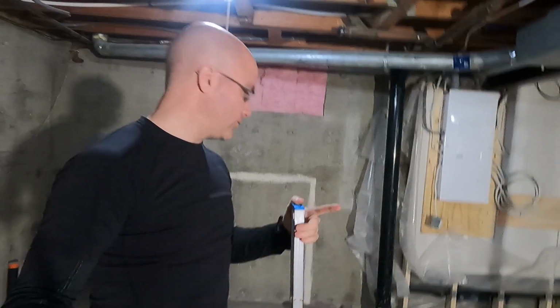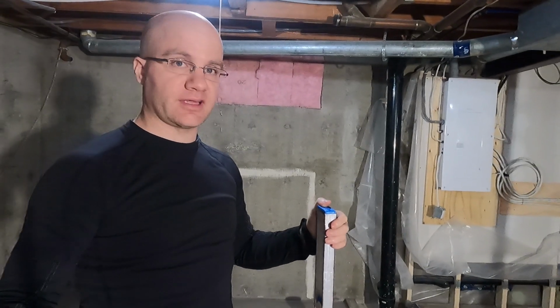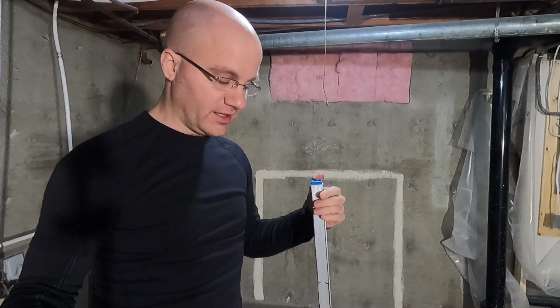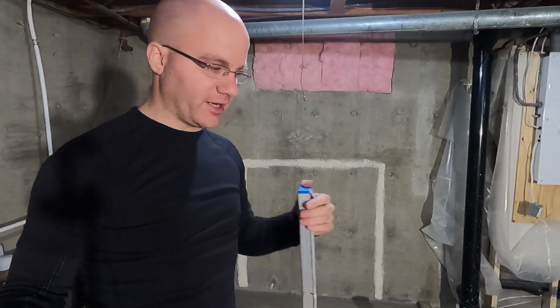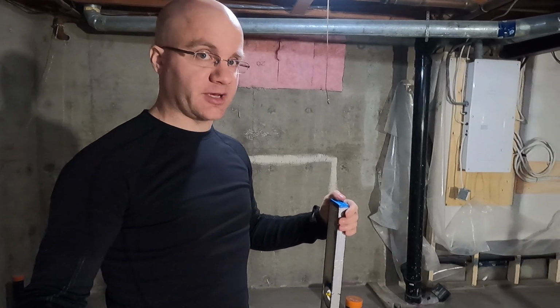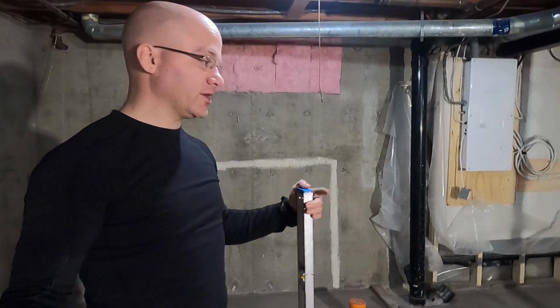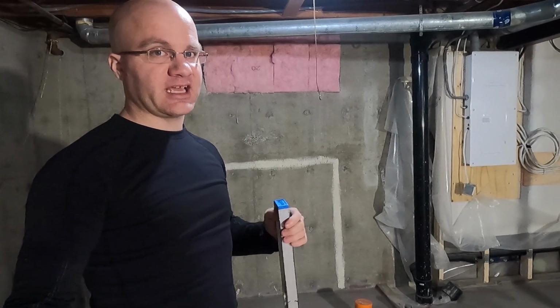And I had noticed that it was not self-leveling as well as I thought that it should. So I had Santa put about another 100 milliliters into the mix for the bathroom area. And that turned out a little bit better. I also used more screws in the bathroom area because I was more concerned about the level in the bathroom area. I'm not going to be doing any more finishing in the mechanical room.